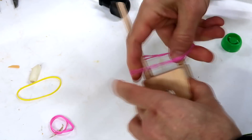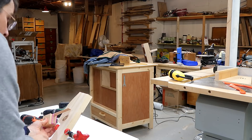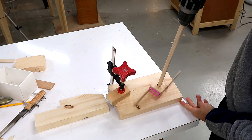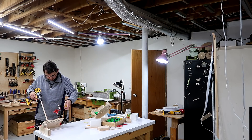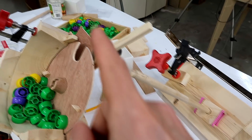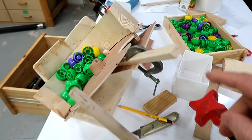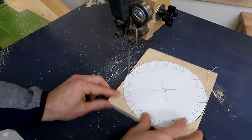These three pieces are going to make up my rotary catapult. With both pieces kind of working, now I just need to figure out how to get the caps from the feeder to the shooter. I was initially going to put both of those on the same shaft, but that involves a complicated chute to get the caps there. So I figured instead to put the shooter right where the caps come out of the feeder, but that involves some gears to power it.